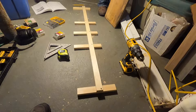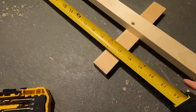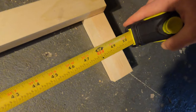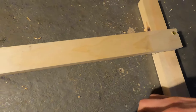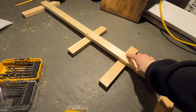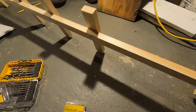Here is the completed product. We have our 16-on-center layout here, then our 24-on-center, then our second 16-on-center, and then our third 16-on-center or second 24-on-center. Essentially this is just a tool to make wall layout go a whole lot quicker and prevent mistakes when doing stud layout. Quick and easy to make — it took us about half an hour, and we'll be using it soon.